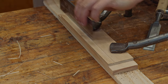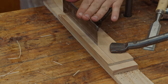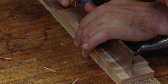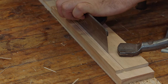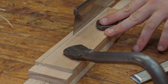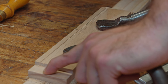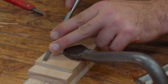You can see now I've got this going. You can use both hands if you need to. This will be easier if you have a longer saw as well. Now you just want to be looking where you're sawing until you've come down. If you see here I'm still up in the air on this rebate just here, so you keep working that until you're down to the depth of that rebate. Don't be afraid if you do hit your rebate down at either end — it doesn't matter too much in the long run. For that cut we want to remove this material here, and that's where the chisel that fits inside is imperative.